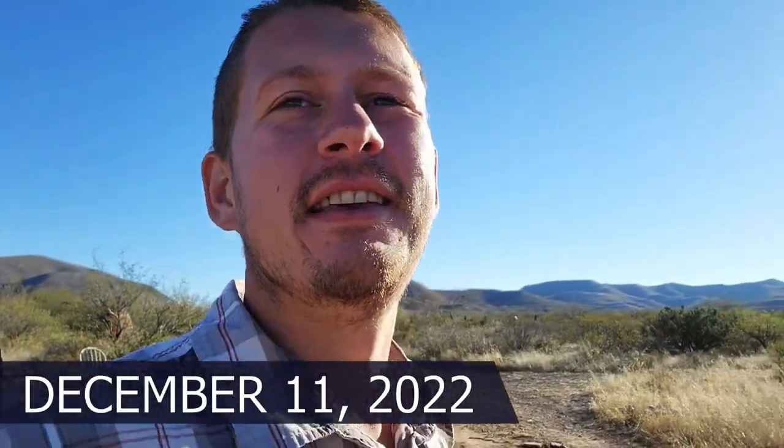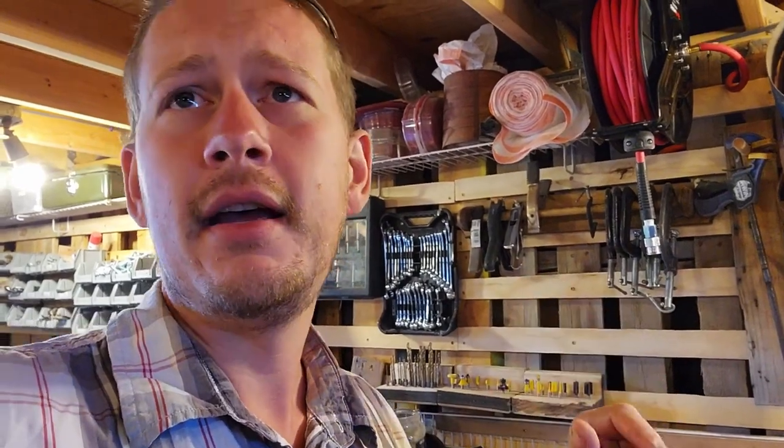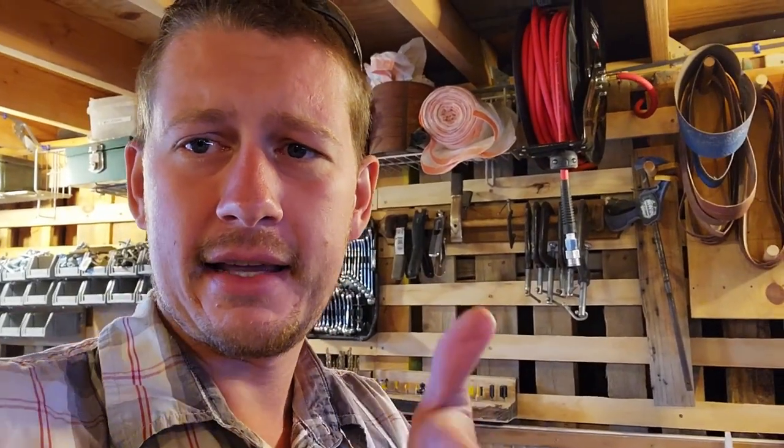Good morning, everybody. It is day 3 of this Hyperadobe tiny home roof build. Was able to get that beam up yesterday, nice, centered, locked into place. It's not gonna move. So now today I can get the rest of our rafters put in, hopefully. My thought on that is to basically cut 3 rafters with the little bird's mouth angle cuts, all exactly the same, marked out how I want them, and then I can just slot that in on the left side, right side, and center, do that on the front and the back, and in theory we should be square.